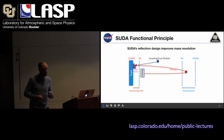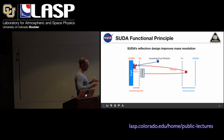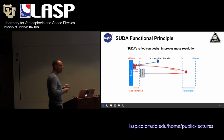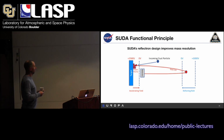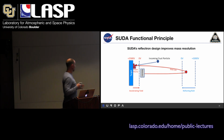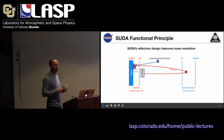So iridium is, from a cost point of view, about like gold per ounce, and we have spent a lot of time and effort trying to figure out how to do this, and we've recently been successful. The target we're making is 235 millimeters, so about 10 inches in diameter, and additionally it's got a mirror finish, a 5 nanometer RMS finish. It's beautiful, and we've taken this to the lab. The beauty of iridium is that when it hits, all you see, unless you get really fast dust, is basically the particle itself. And if we see iridium, we know it probably didn't come from the icy surface of Europa.